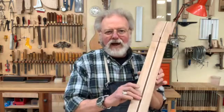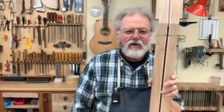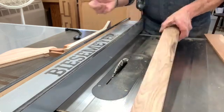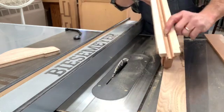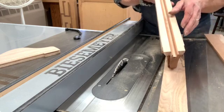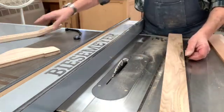I'll show you a little bit about how I centered this up, and I'm going to show you an easier method where, if you have a nice straight neck shaft, you can accomplish this task in just a heartbeat. I'm going to use this piece of butternut as a demonstration — this is a pretend neck. I don't happen to have another neck blank that is not slotted, so I'm just using this for demonstration. What I'm going to show you is how to get your truss rod slot nicely centered, because if you miss that setup and don't have much room to test with, it could really mess up your work.